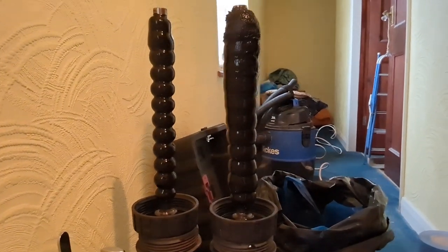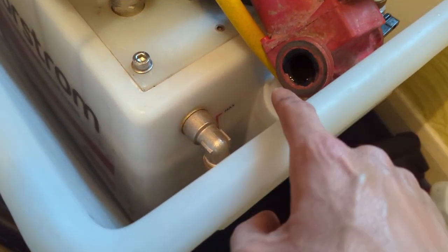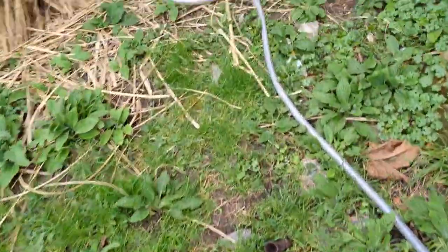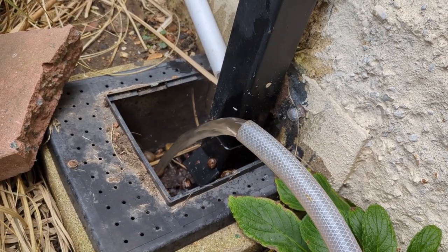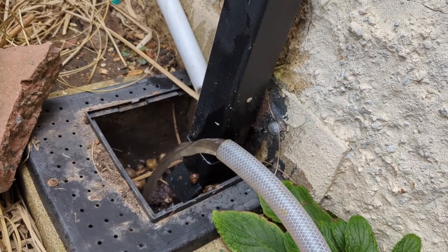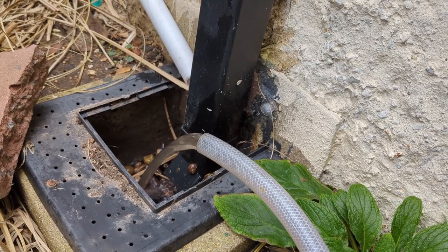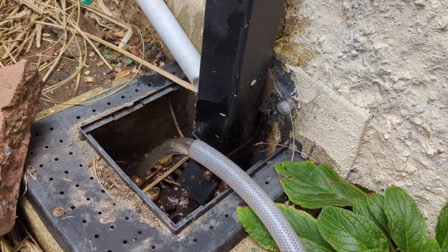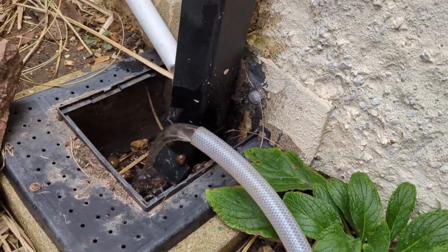It's pretty bad — the water is steaming hot. We've actually got really good cold mains pressure so I've had to put the pump in there just to weigh the hose down, otherwise it kept flying out. Filling it shouldn't be a problem. The dirty water is dumping out here — you can see the colour of that — so we're going to let it run until it runs clear and then move on to the next radiator. When I first started dumping it the flow rate was literally a trickle. I realised one side of the lockshield wasn't fully open, so I've opened both sides and now we've got a better flow rate.